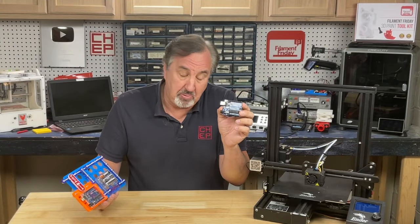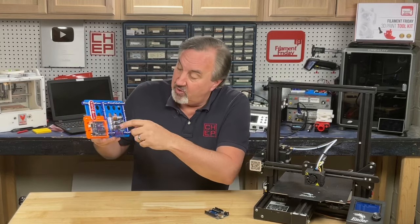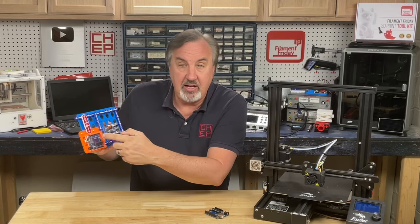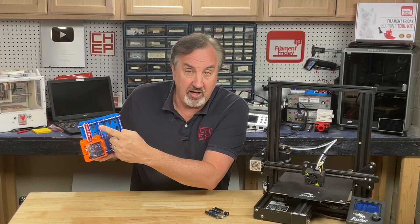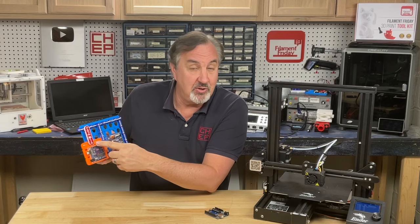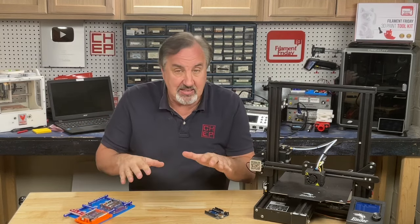When you're first working with microcontrollers like the Arduino, you'll probably flash an LED. That's the most common first project — just a circuit to flash an LED. There's actually an LED on the Uno that can flash instead, but the idea is you're just controlling an output port. It's either high to turn the LED on or low to turn the LED off, or you can wire it such that a low turns the LED on and a high turns the LED off. That's a digital output.